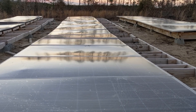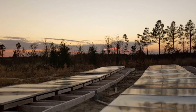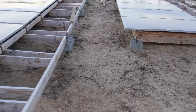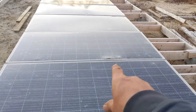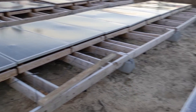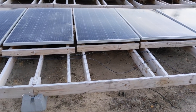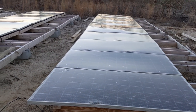That's about 6,000 watts of solar on a super clear, perfectly blue sky day — and we never cracked a kilowatt. We kind of knew it. When you have panels with cells that are busted, you have shorts going on and it's just not going to be good. This was actually able to charge the lithium battery today, but on a perfect solar day we never made more than a kilowatt at peak. We turned on the well pump and the system did not respond or match the load.